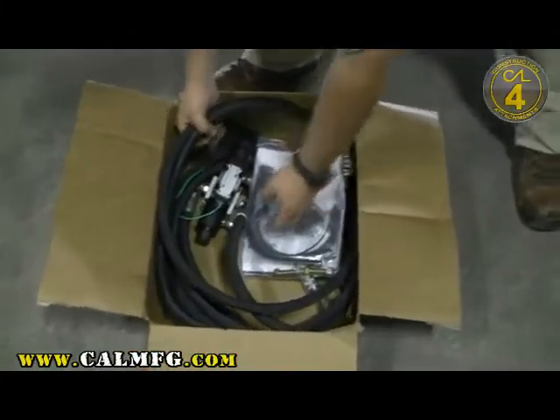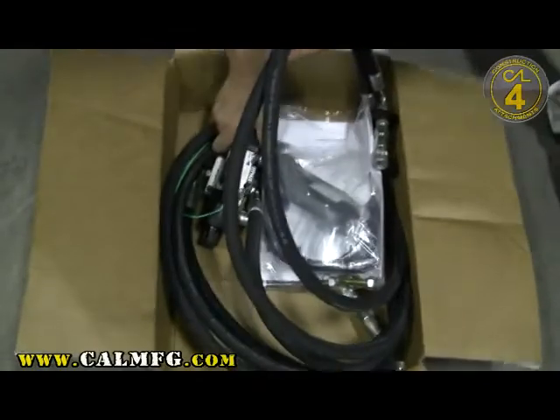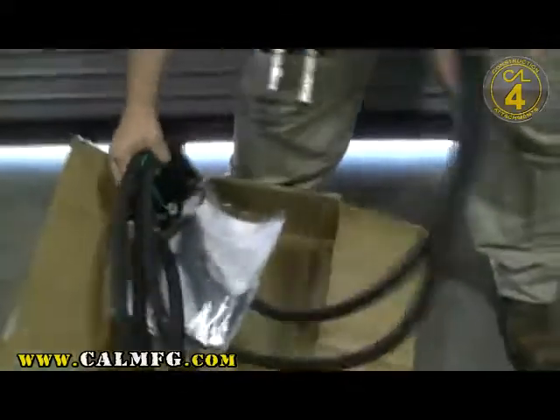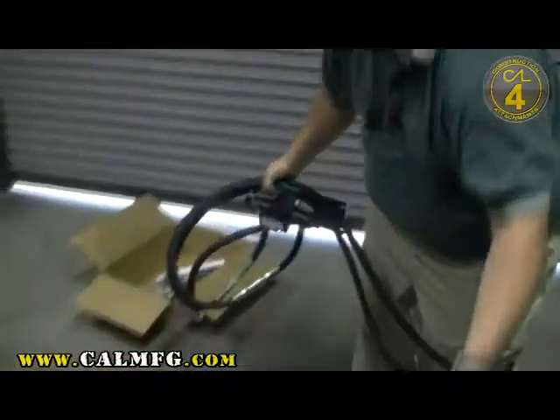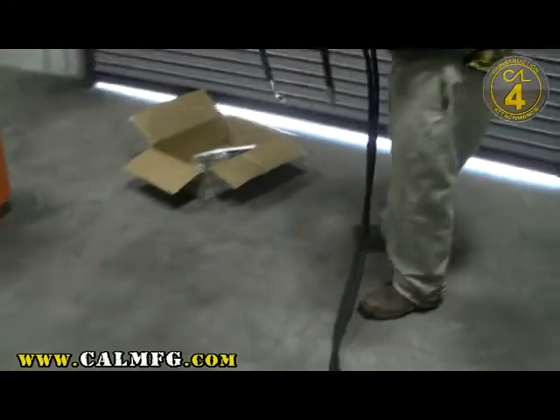When you pull your kit out of the box, we'll have everything pre-hooked up on the kit. If this is the first one-touch kit you've put on, you can actually take the kit out and spread everything out on the floor to know what all you have. Bear in mind, we've made connections through here and they're all hand-tightened — they are not fully tightened because a lot of the hoses need to be turned and twisted. Some connections may have to be taken off. There's a note in your instructions that will tell you this, but as a reminder, you need to tighten every hydraulic connection or there's a very good possibility you'll have leaks.